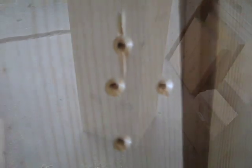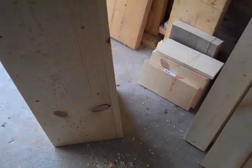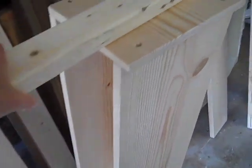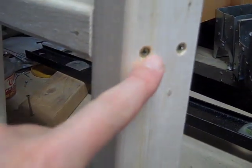Let me glue some of these things together, like these L-shaped posts. Put these screws in — every foot or so — just to hold it together, with a line of glue, so these things are quite solid. There are a couple of other things we glue together, like this shelf unit that will be auxiliary for the closet, the other three L-posts, the ladder — which gets glued together with three-inch screws, two in each rung on each side — and this special back shelf.